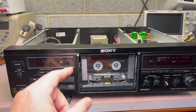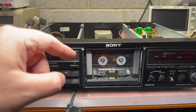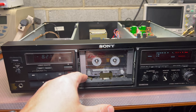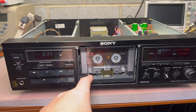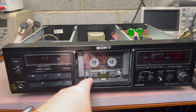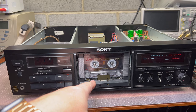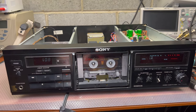But to tell the truth, the pros and cons of this tape transport. First of all, I like that everything is built from metal. Then I like the springs which push the pinch rollers, that they are spiral springs and not, as in the later models, springs put directly into the pinch roller assembly. Those don't hold pretty well over time. I had a couple of times when I needed to adjust them to make sure that they push with the proper tension. This spring is the same as in Nakamichi's or other models I've seen. Akai's, when they just use regular spiral springs, work much better.